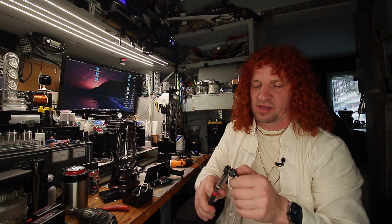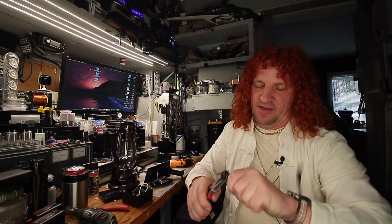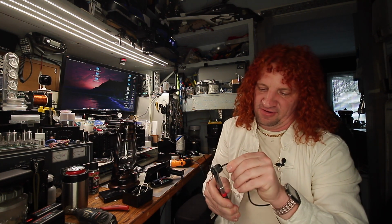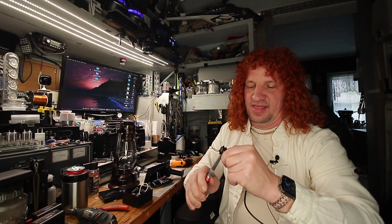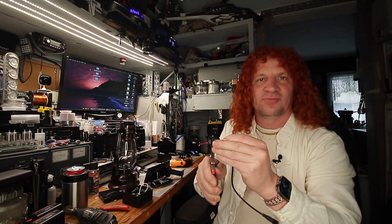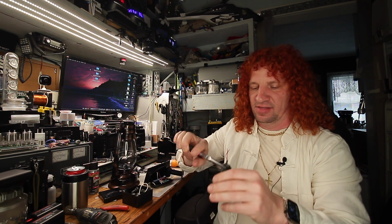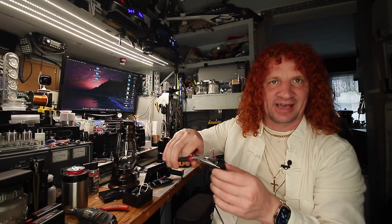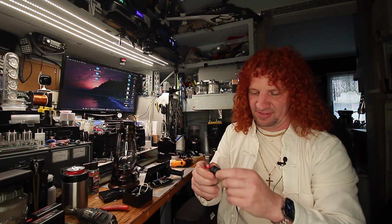So these may or may not close tight enough to crimp these wires for weatherproofing. I might have to do a little further. Well, pretty close. They actually do squeeze down. They're a little loose, though. But we can put some silicone in there or something like that. Or even backfill the backside of it. And maybe we'll put some UV resin in there and cure it, and that'll take care of the water intrusion. So that's pretty cool.